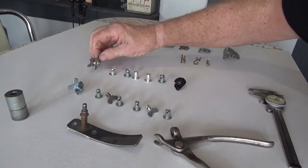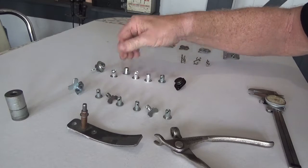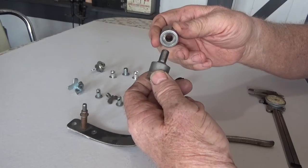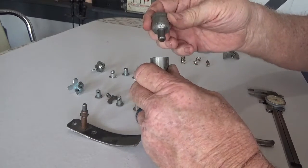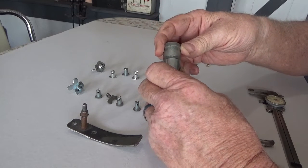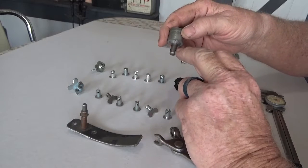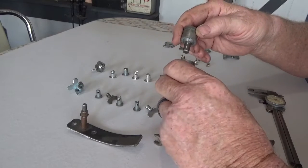So I've talked a little bit about fasteners — we got self-ejectors, we got flush head, and then we've got oval head. When you do a flush head fastener, you use a tool like this which came from Millspec. I modified this one a little bit. Usually they put a bolt through it, but that's a dimpler — that makes the dimple in the aluminum so the flush headed fastener will work. Tiny bit more labor. You can just drill a hole and use an oval head button, or drill a hole and use a flush head button. Typically when I'm drilling the holes, I'll drill it to that size on that stem, which is like three-eighths of an inch. Use a step drill, of course.